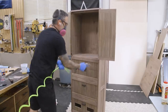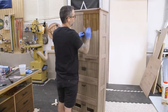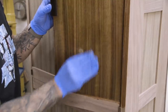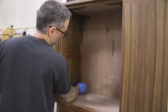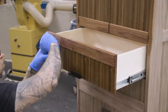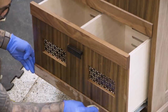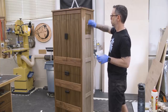So now I can blow the dust off and apply the hard wax oil finish. This walnut is gonna pop. The inside of the upper case will get finished, but I don't plan on finishing the insides of the drawer compartment. This is primarily due to the fact that bread and veggies will live down there, and an oil finish like this carries a lot of residual stank that lasts for a long time. Nobody wants stank on their taters. Few woods experience the drastic transformation that walnut does when hit with an oil finish. Gorgeous.